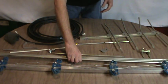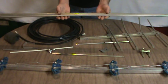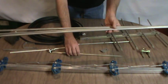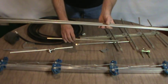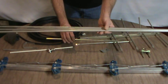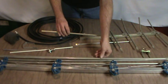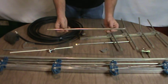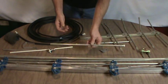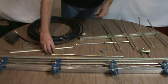We have VHF elements to build the antenna with. I've got four, and the longest element is going to be over 40 inches long, so you'll need elements that are long enough to be one solid element all the way through. And then another half a piece of tubing for the gamma match.